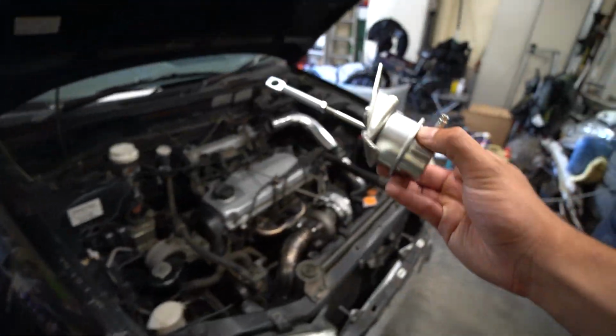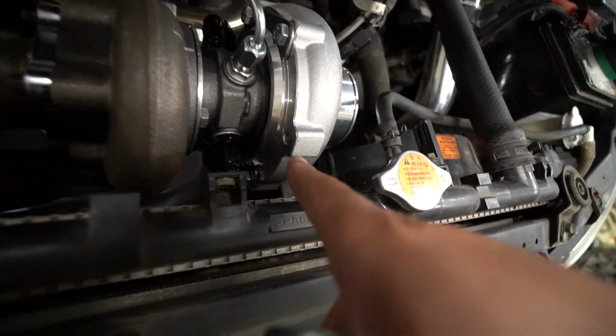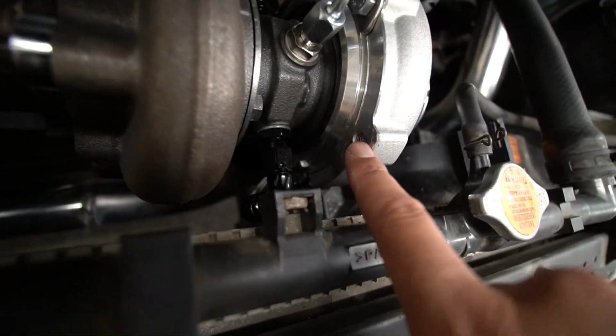So we still have to install this thing so we can at least have the flap closed, and we still have these bolts not installed. That's why in the previous video we tried to hold the internal wastegate shut, but it wasn't actually sealing at all, because I guess all the boost was just coming through those little holes there. So next video we're going to have to take off the turbo again and sort all that out.